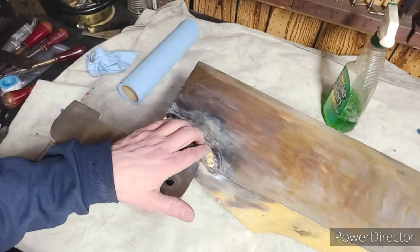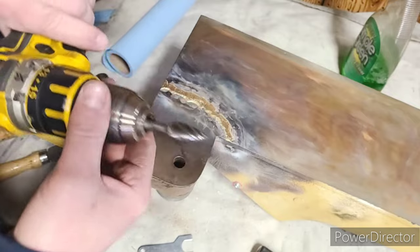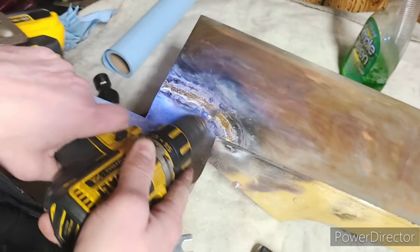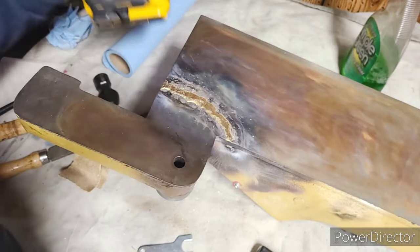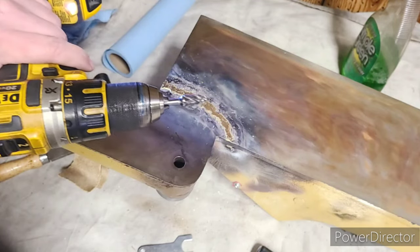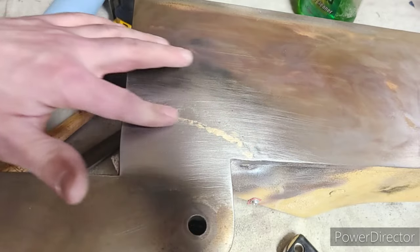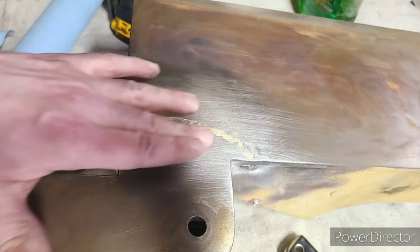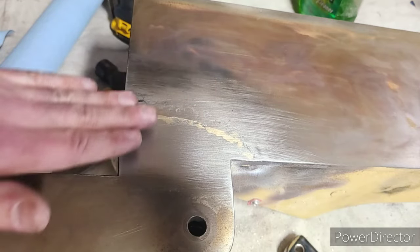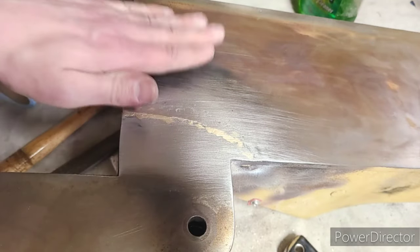The next step is to clean this up with a series of varying grits of sandpaper. I actually opted to use an aluminum die grinding bit, and I'm just using my drill because it's a lot more maneuverable — just going through removing material. The nice thing about this bit is that it will not gum up like a normal die grinding bit would with a soft material. This is making pretty quick work of it. We've got this braze sanded down with 80 grit about as far as it'll go. There's an ever-so-slight hump in there still. I'm going to go ahead and move up to 120 grit, clean that up a little bit more, and eventually clean this whole thing off with maybe a Scotch-Brite pad.